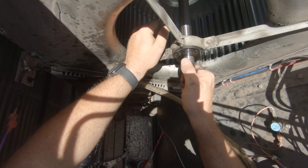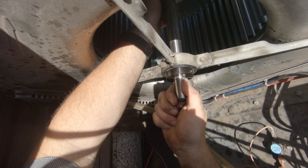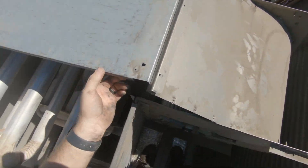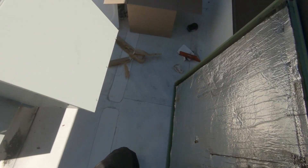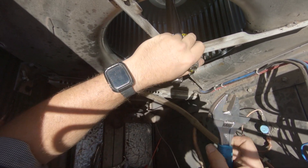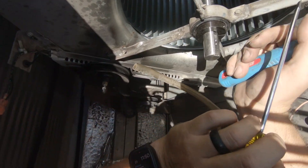Now we need to line up our keyways on the blower wheel and shove our key in there. Our alignment looks good — we already got our keys in there. The interesting thing is because I have those little dimples from the set screws, I can't get it in all the way as much as I'd like, so we're gonna use a screwdriver and tap on it a little bit to get it in there. Again, if you can use new keys, do it. That wasn't so bad — we got that one in place.